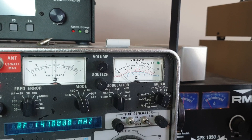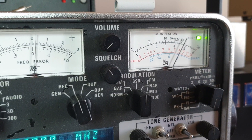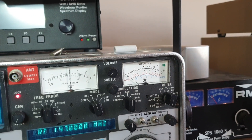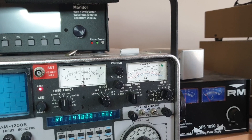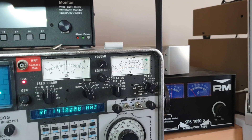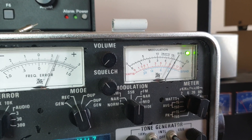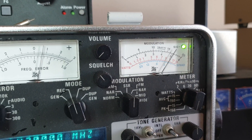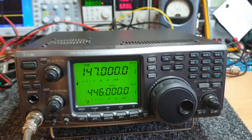With a one-meter-long lead costing under $20, look at that — 95-odd watts on FM carrier. Going to sideband — hello, one two, hello — PEP over 100 watts, just over 100 watts, with just a change of power cord. That's all it is.